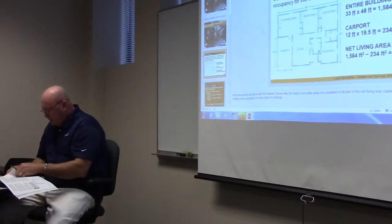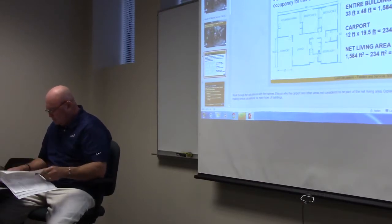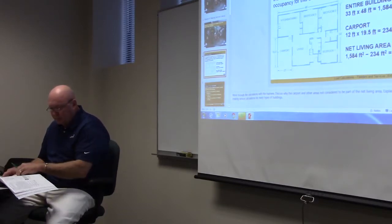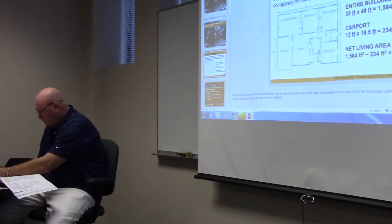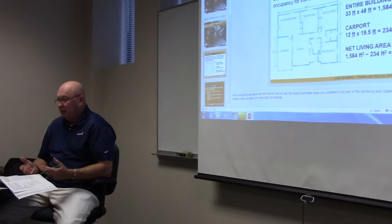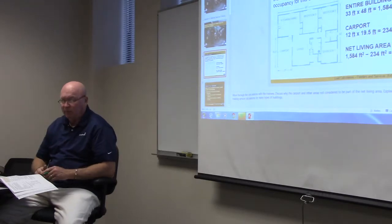All right. Number 13. Cameron, how about reading number 13? Many inspection jurisdictions and utility companies now require a blank study prior to the issue of a permit. Any idea, guys? Fault current. Yeah. Fault current study. Can that vary from place to place? Yeah, because the fault current depends on the local utility company, right? It's not anything we do. It's just something we get information from. And so you better make sure that your panel is rated to at least that fault current rating, right? If it's less than that, then you're in trouble. So it's got to be more than what the fault current is.